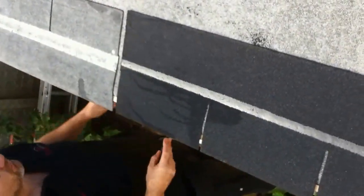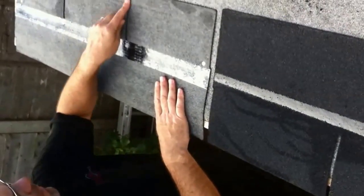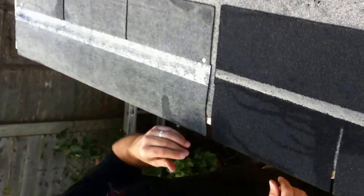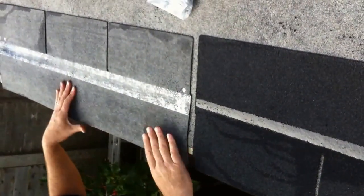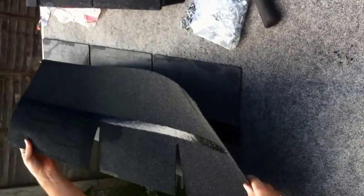This is how we start the felt shingling on a tile roof. Notice this one is upside down — normally when you lay your roof you have the slots going down to give you the tile effect, but if we laid that one first that way round it wouldn't be watertight because the water will go in here, so you lay the first one upside down.